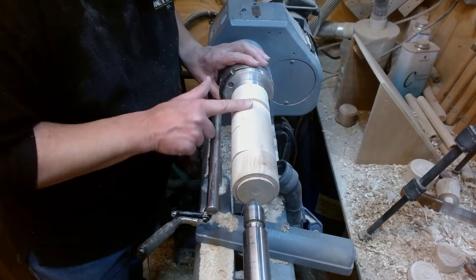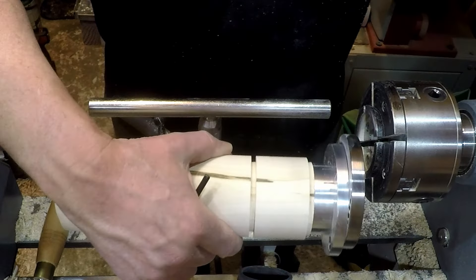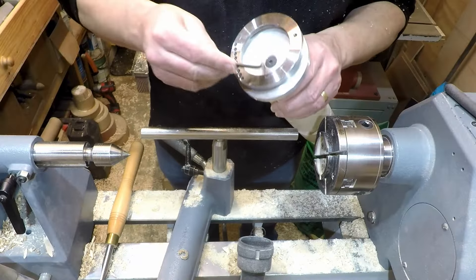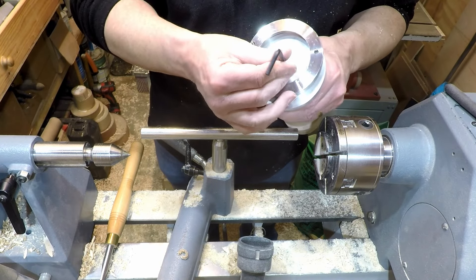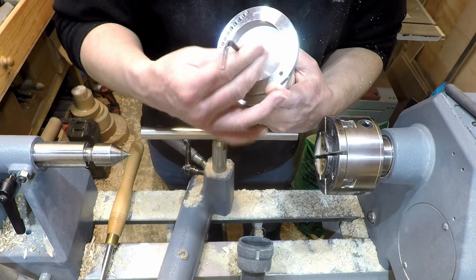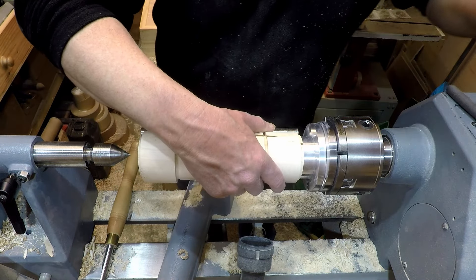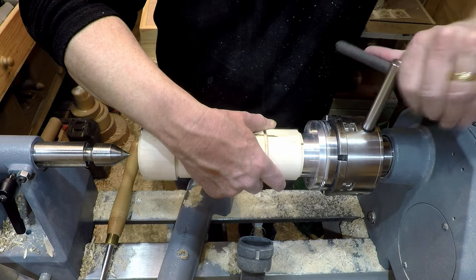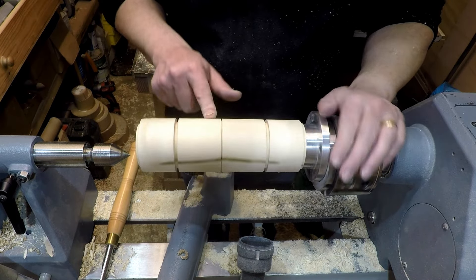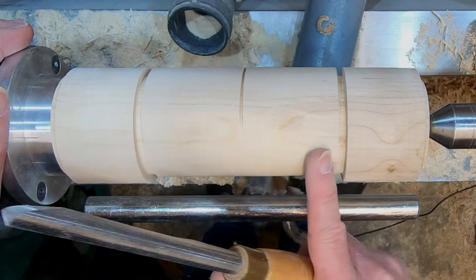I've now gone through the grits and sanded this to 600. I'm going to rotate this around, release it from the chuck. This index point here is where I need to rotate it two places — the holding screw on the back rotates two places, then I rotate the chuck two places. This time I'm going anti-clockwise so I've just got to remember that. Just nip that up a little bit and go back on the chuck. I shouldn't need any adjustment with the tool rest because all I've done is rotate the work on the chuck itself — and now I'll be cutting this next side. I'm going to turn this bit down to the depth lines at each end with a straight edge. Taking the speed up to about 1000 again.